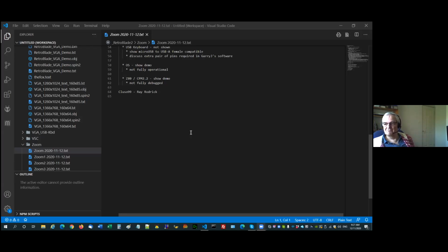But they all take a considerable amount of time to initialize. So I'm trying to remember the sequence of events because there's some exchange going on. So I do a reset pulse, and then I wait. I have to wait before I try to do anything, right? Yep. But here's a problem. I only wait 100 milliseconds in some modes, right? So we have to put like P59, is it high?